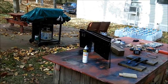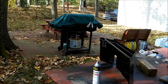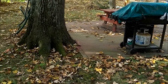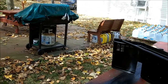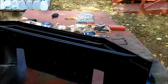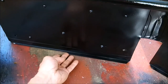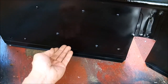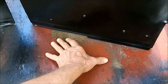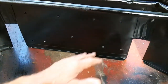Now, if I was to just put this on the mower and not run the mower, yes, I could plow the leaves, but it goes easier when the mower is chopping the leaves, because they can't come out of the discharge chute because that's closed off. So in this area here is where the mower is cutting. So this is 2 inches off the ground, or wherever the lowest part of the mowing deck is. So in this area here, 20 inch in this case, the leaves are getting chopped. What's not getting chopped is getting pushed along.